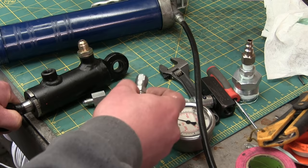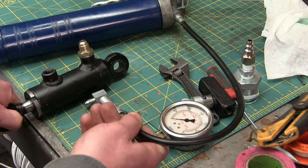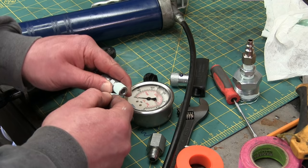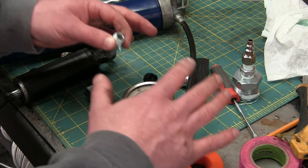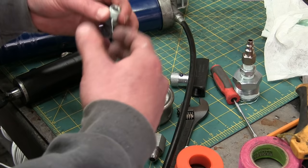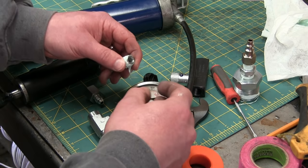We go quarter inch run T into a bushing to one eighths, and that'll jam in here. Then we'll walk this off - that'll be quarter inch, it'll go into the quarter inch. Bob's your auntie. Now if you're not familiar with what you're building, I'd definitely go with pneumatics. However, it's not without its danger because air is a compressible fluid, so everything in that system is like a big spring. With hydraulics, once you get all the air out of the system, the only thing that's springing is the lines, so there's not as much energy built up. If something blows up, you just release the pressure quickly and it's dissipated. In a pneumatic system if something blows up, there's still all that pent up energy like a spring that's got to be released. So you've got to be cognizant of that as well.